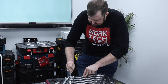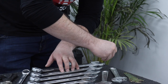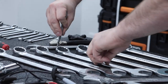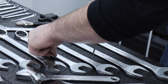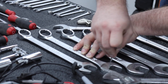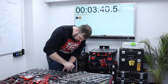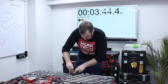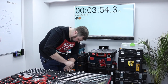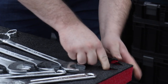We've got a full set of spanners here from 6mm all the way up to 32mm, so we've had to split that across two drawers. Because these are quite long spanners, we've laid them out diagonally to try and maximise the space. All I'm doing is holding the scalpel 90 degrees to the item and just using it like a pencil — there's no need to draw around the item. With Easy Peel we will have to factor in finger pulls, which we'll do after we've cut all the tools in. The layout of a tool drawer is definitely worth spending extra time on to make sure you're using every quirky space while maintaining neat categories — you want to find everything easily, so you're not sacrificing organisation for the look. Okay, so that's everything cut in, so I can just start peeling back the foam.